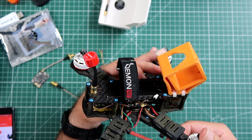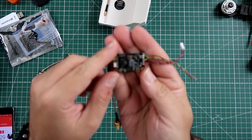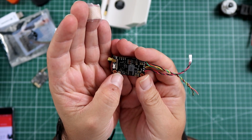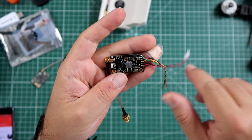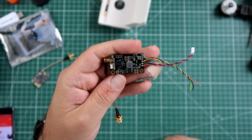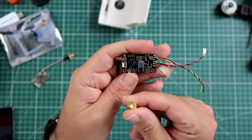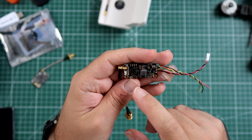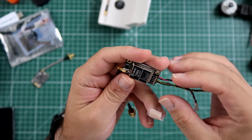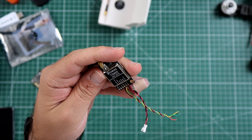The build quality is reasonably good. There is a built-in microphone so you have an audio feed. There are none of those stupid connectors — you just solder cables and you're good to go. There's a big choke suggesting the power section and voltage stabilizer are decent quality. The MMCX connector and 11cm pigtail are great. There are LEDs indicating the channel, band, and power level, and one button to switch between them — everything you really need.